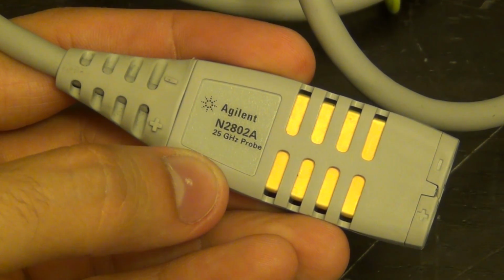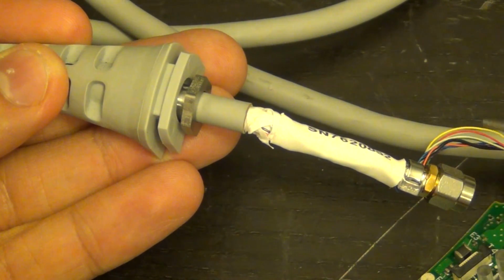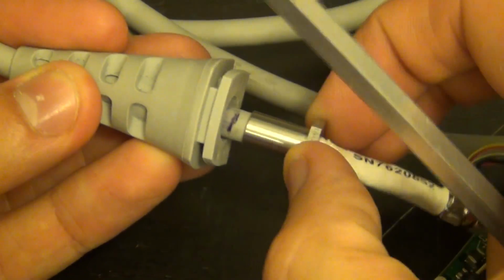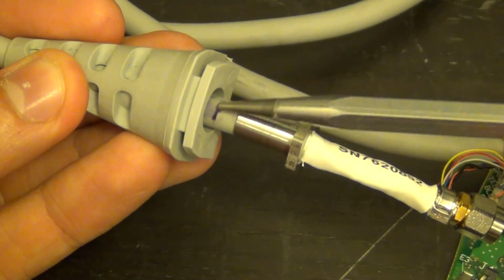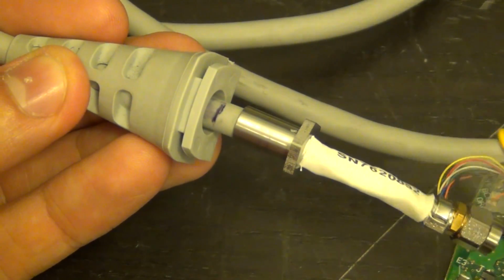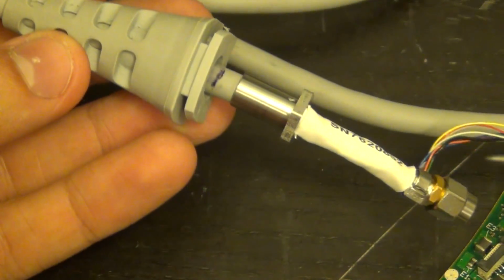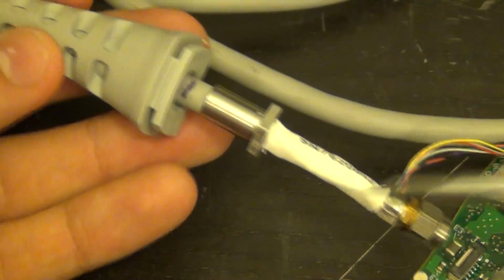It should be cool. One other little thing, this is of course the 25 gigahertz coax that goes through and has other cables wrapped around it, but you can see that they have a metal piece here which protects the plastic edge of this cable against the metal edge of the chassis at the end. So they've really thought this through to improve the life of this component, because you don't want to spend $23,500 for something and have this cable get cut because you're bending it and moving it around. So they've thought about making this as robust as they can.